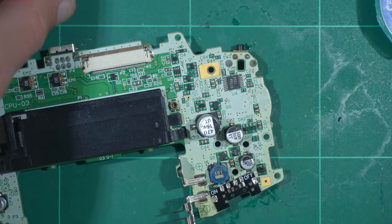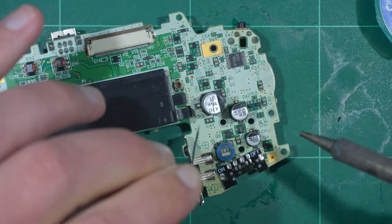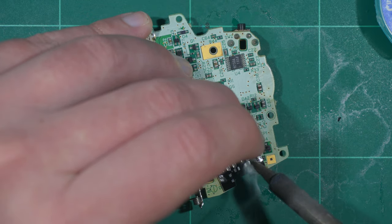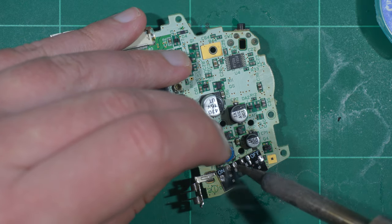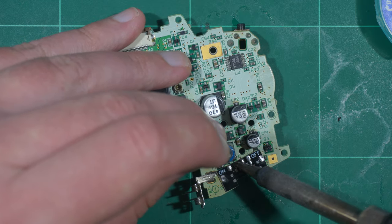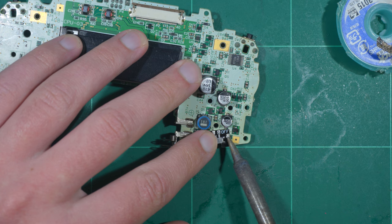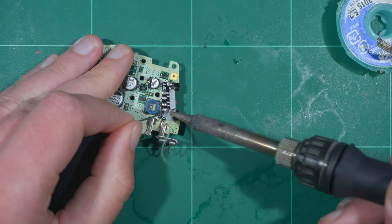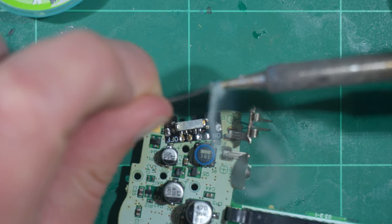After a clean, I soldered on the mounting board, which aligns with the pads. Like with the capacitors, I anchored it into position before soldering the rest. I added a bit more solder to the sides than usual, because the switch is a physical point of failure from flicking the toggle back and forth — hopefully this will secure it more in the long term. I then soldered the switch to the mounting board. I still don't understand why it doesn't come pre-attached; my only guess is that the parts were sourced from two different places.